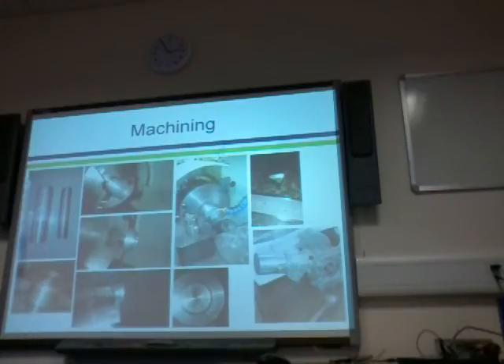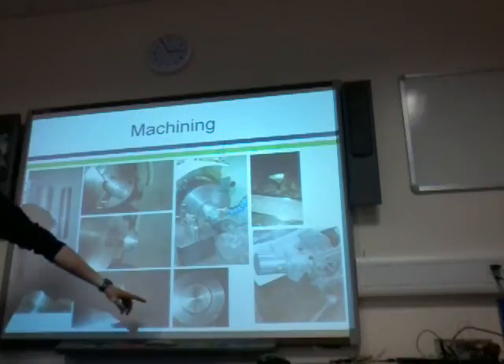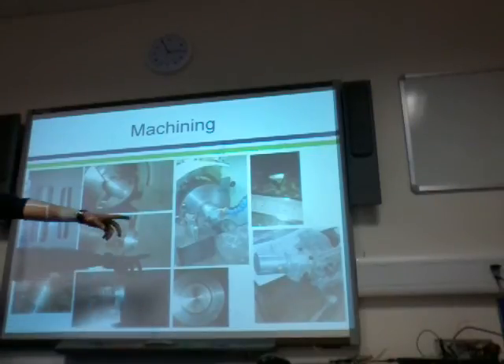I've got a few pictures here showing that. This is my stock to start with. These are the three main components of the valve along with the piston. The piston's made of stainless steel so that it doesn't rust. Up here is the tool I used to cut it — a one and a half millimetre wide cutting tool, which I had to grind myself. It's actually quite dangerous because that sort of tool is really delicate and you have to go in very slowly. Otherwise it'll just snap off and you have to make a new one. That is the piston seated inside the cylinder to show the fitment, and the bottom right shows the piston and its rod, and the rest of the valve put onto the engine.